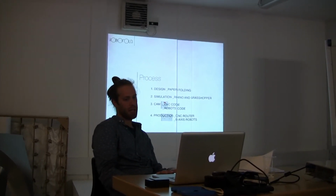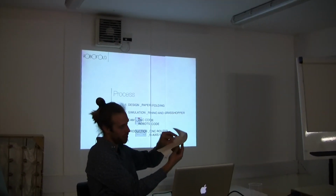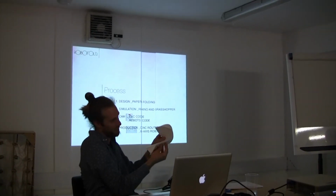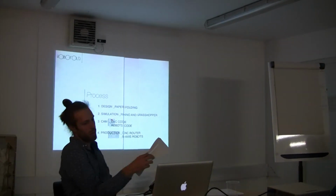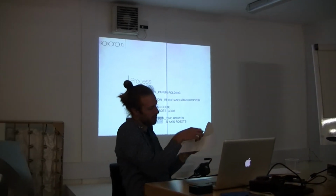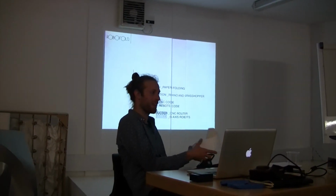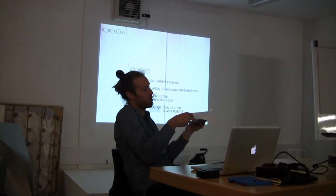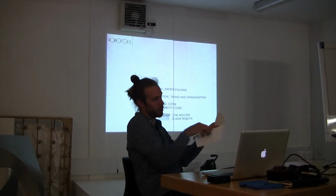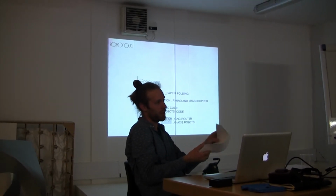But we had to do that because when you start folding this, there's such a complex curve, a path through space occurring, that we can't record each one bit by bit and get it right, basically. So we do all that as a simulation of a folding and just take one of these points as it moves through space and say to the robot, just follow that, please. Which is nice and easy in the simulation, but in the real world we reverse that and say, if you move through this path, the material will have to follow that, as long as we put the piece of material in the right place, as it is in the simulation, it will then form it.